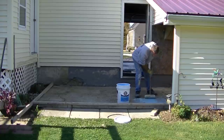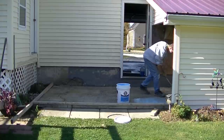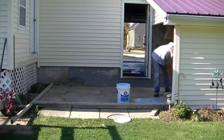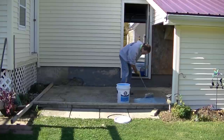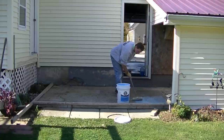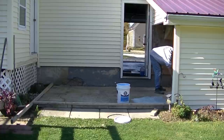How we install this is just with a brush. We brush it onto the old concrete and make sure we get a good coating on there, and then we let it dry. Then as soon as you pour the new concrete over it, it reactivates it and the two concretes will bond together. It's a real good product we use a lot, and I highly recommend it. I'll have a link for it down in the description.